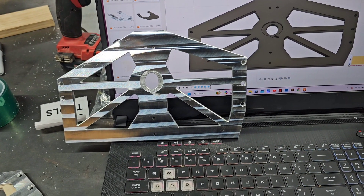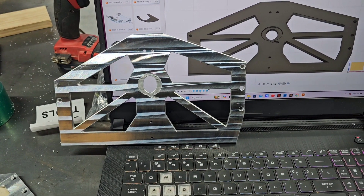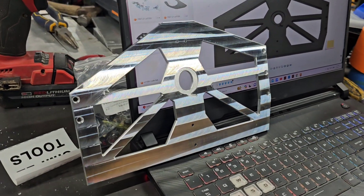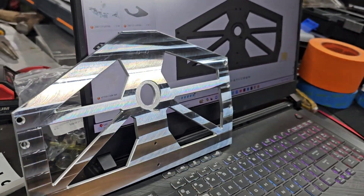When I ground off the little tooth on there, I made sure to remove about the same amount of material on the top of the other side, so I just have one tooth going in a big circle. I lowered the feed speed down and the finish is killer.